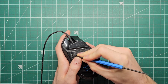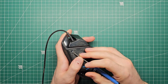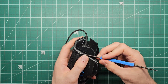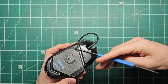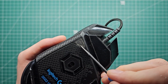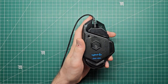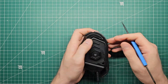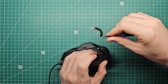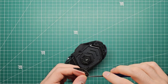Now I'm going to carefully try to pick out these feet using a sharp pick object. If we're slow and steady about it we may be able to reuse the glue on these. I've read some things online suggesting that this destroys the glue and you have to buy a replacement set of feet, but I'll just see what happens. I'm slowly rolling the pick towards the direction I want to open up, gently lifting the glue pads — and yeah, it looks like that's going to break as I pull them apart. Those pads are not coming out gracefully. I can feel a screw hidden underneath here. The glue holding this down has pretty much disintegrated so I don't think I can reuse this. I'll have to buy some new ones or just use the mouse without.